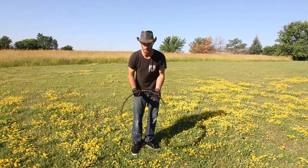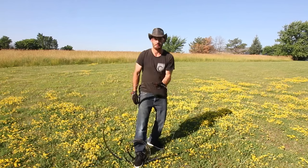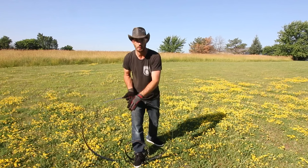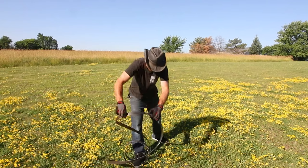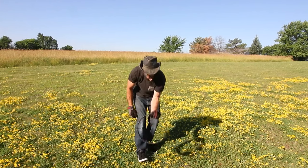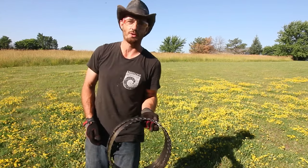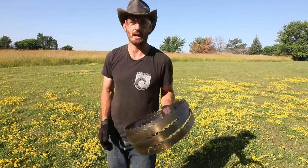Now I'm going to show you one cool little trick as a bonus. We're doing something called a double coil — basically all we're doing is making two loops that are smaller than one big loop, and we're going to 360 this. When you do that, you want to make sure you end up with two loops on one side and one loop on the other. It doesn't matter which one is which — we're just going to 360 it like we did with the beginner method. You want to dress it nice and clean, and that is a five-coil bandsaw. Generally you don't want to hang your blades like this because they have a really bad tendency to bear trap on you, so you don't want that. But if you're ever going to try and ship a blade in a box, it's a lot more economical to do it this way.